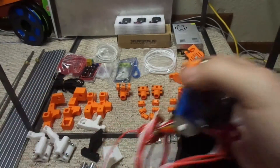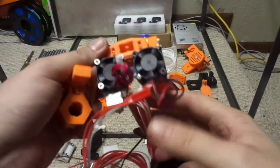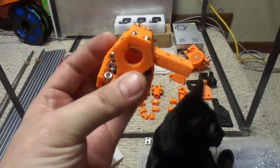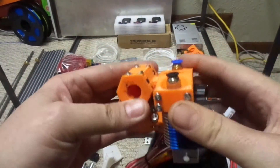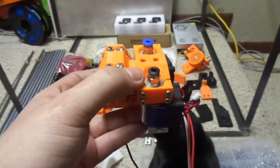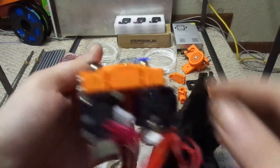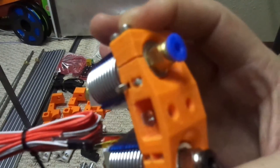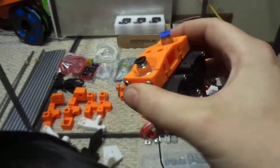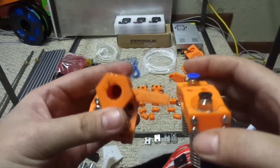The entire assembly comes off. This is both of the E3D clones that I got. These will be sitting on this - this goes on the X and Y axis, and that goes in there. The bar actually goes through the middle. I haven't designed any cooling ducts or anything like that - I'll probably do that later. I could probably mount those on top here, because the bolts are actually inside of there. I'll have to do wiring and all that later on.